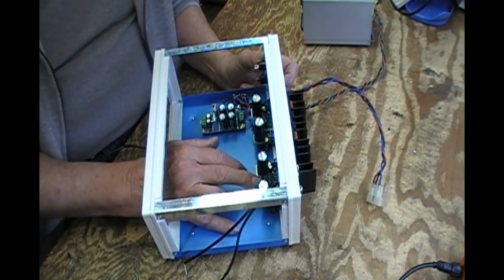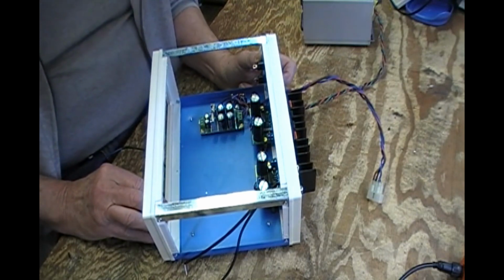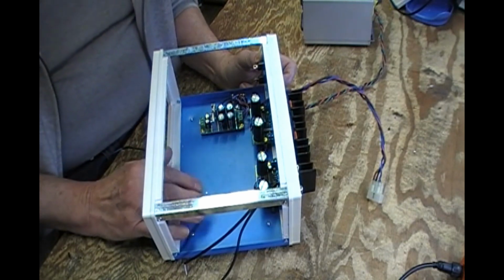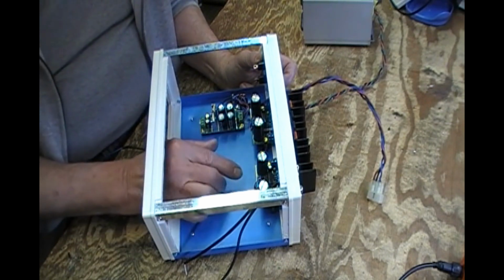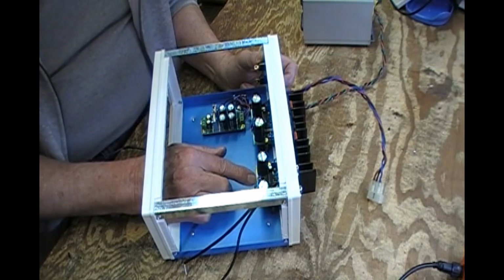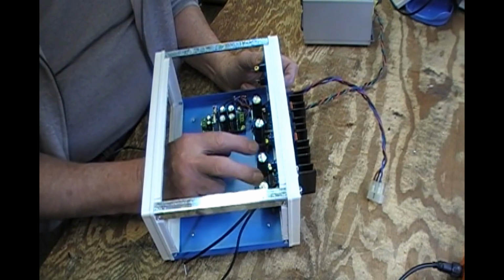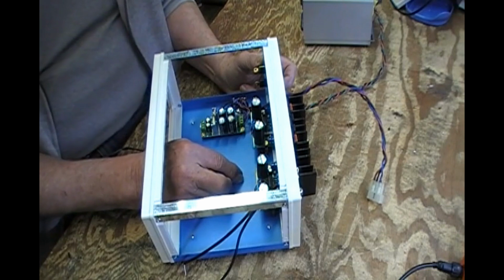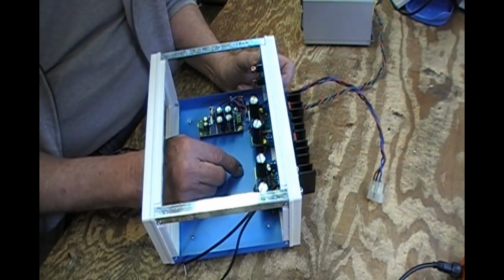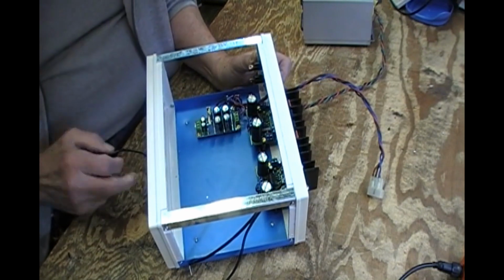Okay, so a curious thing, as I'll get back to it, is if you supply plus and minus DC into your AC inputs of these things, it really doesn't matter, because as long as it has a bridge, the appropriate diodes will conduct and put the appropriate voltage on the appropriate capacitor and input to the IC, no matter which way you put it. Only two will conduct for that particular point. I've done it before and it works very well.